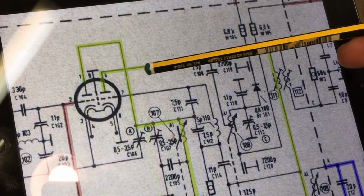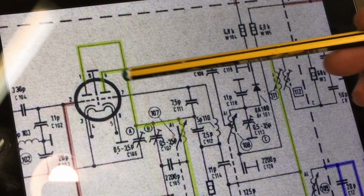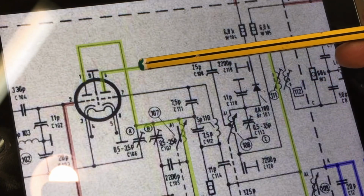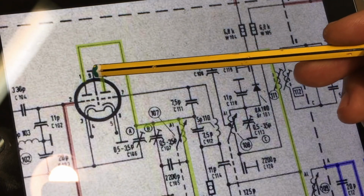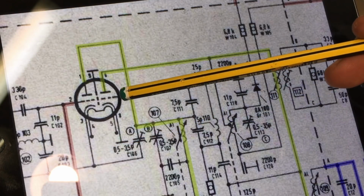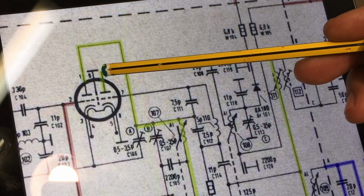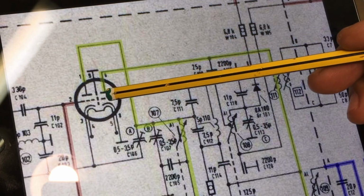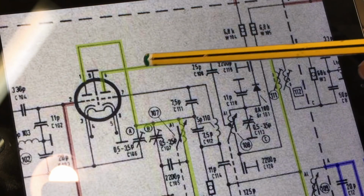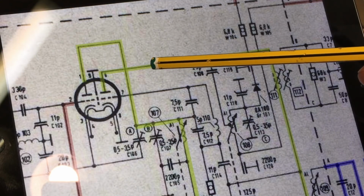That is the mixed signal that comes from the front end amplifier, the oscillator, and the mixing effect of this circuit. So the signal coming out of here has the frequency coming in, the oscillator frequency, the sum of the two, and the difference of the two. It's a jumble of frequencies, but the important one for us is the difference between the two, which should always be 10.7 megahertz, with the audio superimposed on that by frequency modulation.